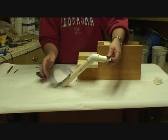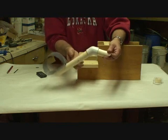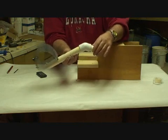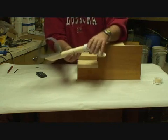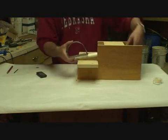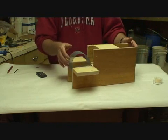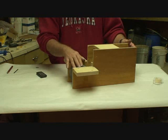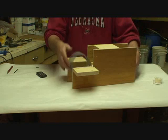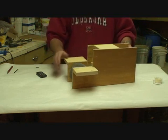Alright, there's our swing arm after we've cut it in two. We've put a 45-degree coupler in here. This is still very lightweight and very tough. You don't have to glue this. I think you can just friction fit these together. Not much pressure on those, so they should be fine. And now you can see when we put that in the elevator, now the cage goes all the way to the floor of the trap. There are no clearance problems with the swing arm back here. And I think we're ready to balance this thing and tune it.